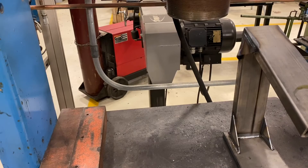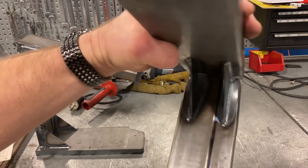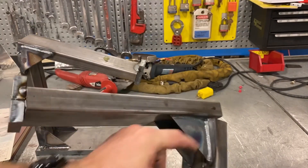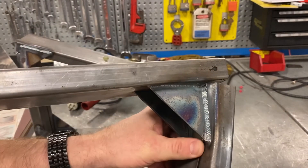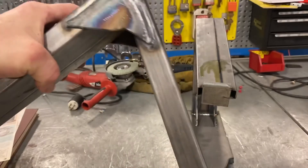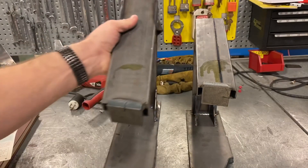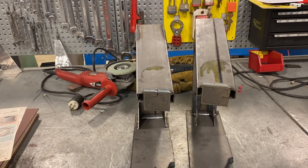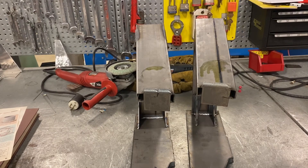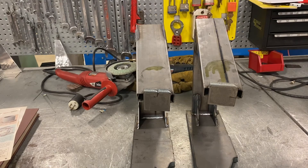Very interesting to see the difference here. As you can see in a side-by-side comparison, they both actually did pretty well. My guess on this tubing, though, if we would have kept pushing, those welds would have torn and ripped the center of this out. You can see how dented and deformed that material is. Because if we look at the other one, while the weld did tear in this corner, it still did not deform the tubing — the gussets actually did most of the work and held that piece in place. Something to think about when you're building things and designing gussets to give something strength. I kind of predicted an epic failure in the one where they were mounted on the inside, but it just goes to show the strength of your welds — if you do something with a good weld on it, it will hold up pretty well.